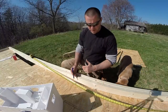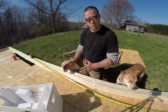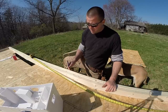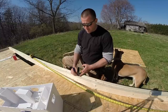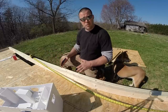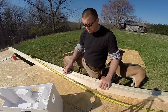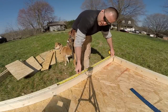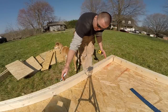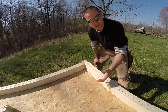At this stage you should already have all your windows figured out. If you're going to Lowe's or Home Depot to buy windows, go there now — even if you're not purchasing yet — and get a list of exactly your rough openings. When you place your jack studs, remember each jack adds an inch and a half, and you also want a little bit of wiggle room so you can shim the window to make it level. I'll mark three foot three, which will end up giving me three foot on the inside. Now that I have all my windows and doors laid out I can go back and put in my markings for my studs and cripples.